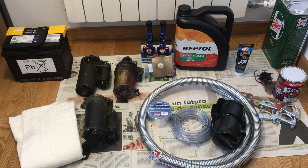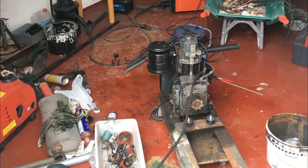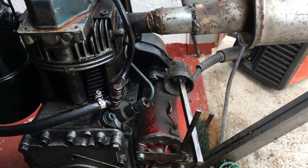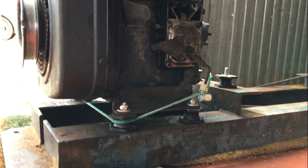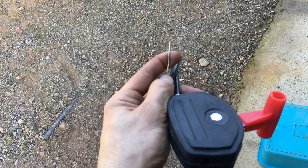What else have we got? We have a lock for the door, some diesel injector cleaner, a couple of starters — I need to scavenge the solenoid from one of them — a brand new battery, and engine oil. This is the high-detergent oil the manufacturer recommended for my climate. Here's a clip starting the engine without a working solenoid. The throttle itself is just a string now, so I've bought this proper throttle from a lawnmower. The cable is pretty stiff — I like it.